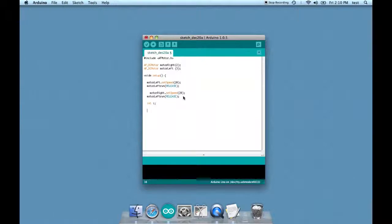Now we're going to use this variable i, and that is for purposes of having the motors pulse a little bit rather than going at a set speed — they're going to kind of speed up to their full intended speed. Since I have limited space to show this off, I'm going to have the robot go forward and then backwards and then repeat. So we're going to have four total commands for the motors: two going forward — one for the left, one for the right — and then two going backwards for the left and the right.